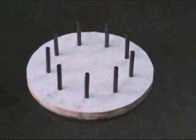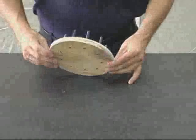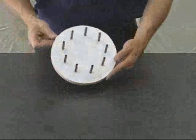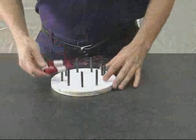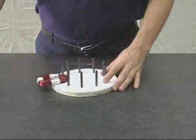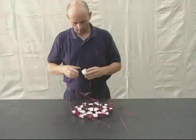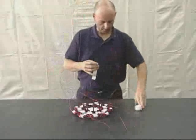This is another simple fixture that you should make in your shop. A full-size pattern can be downloaded from our website. The fixture is used to temporarily hold the coils in place while they're taped and soldered together. When placing the coils on the fixture, be sure that the winding direction is the same for all of the coils, then tape them together.